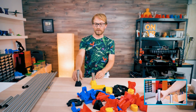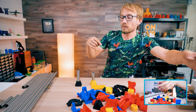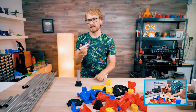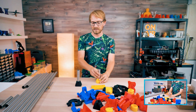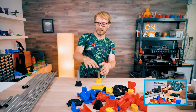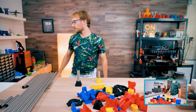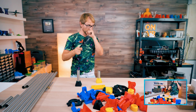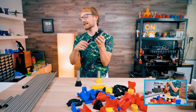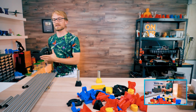Basically, if you make these longer, your tool is going to be further away from your work surface. So I did cut these 10 millimeters longer than they need to be, because I'd rather have the entire thing propped up a bit more, because we can always put another sheet of MDF on the work surface, or if you're using a vise or something, this is about 20 millimeters tall. And this is going to prop up the part anyways if it's clamped in this vise.